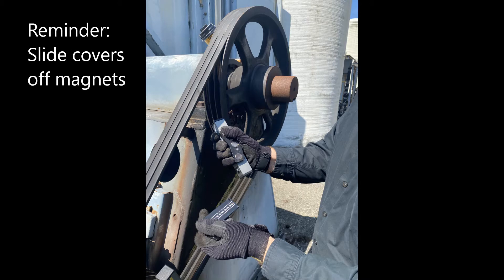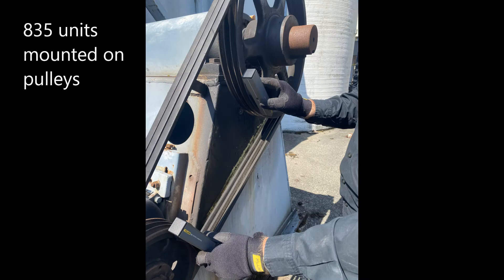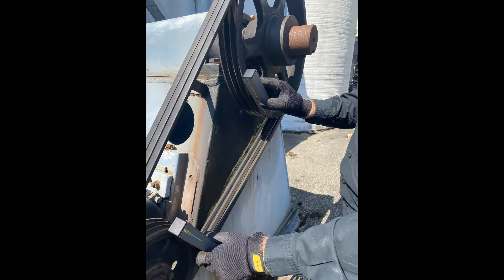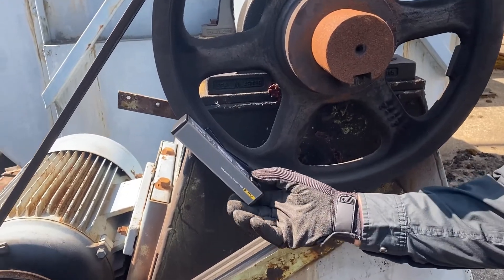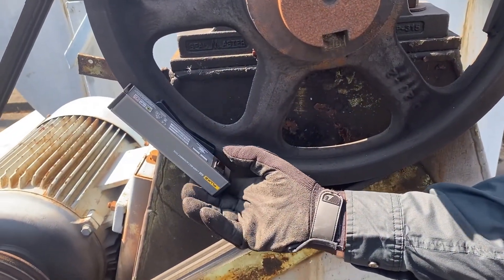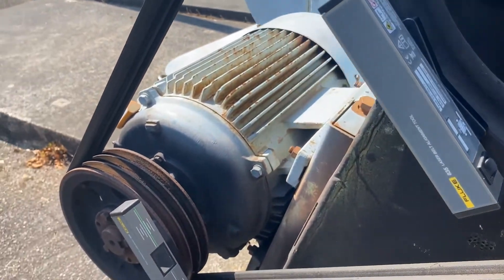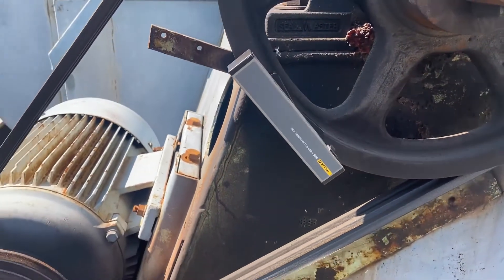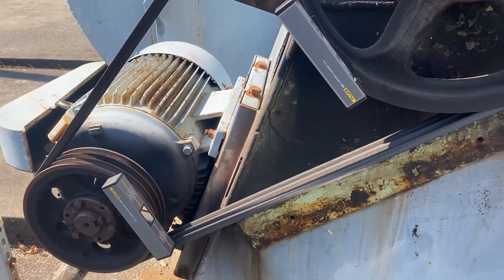Step 2 from the quick reference guide. In step 1 we mounted the 835 units; now we will power on the 835. Here we see a machine with the 835 units mounted on the pulleys. Press the button on the laser unit to turn on the 835. See the green laser on the reflector unit, then see the green laser reflected back onto the laser transmitter unit.